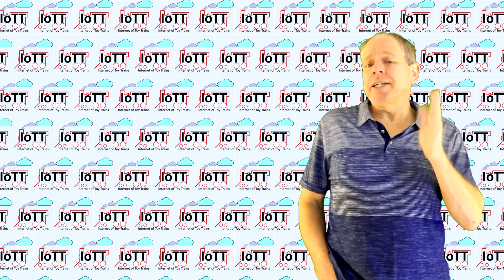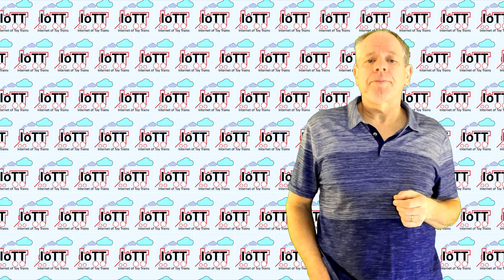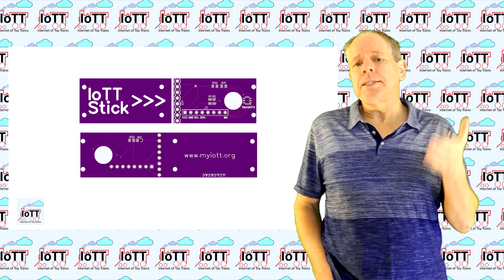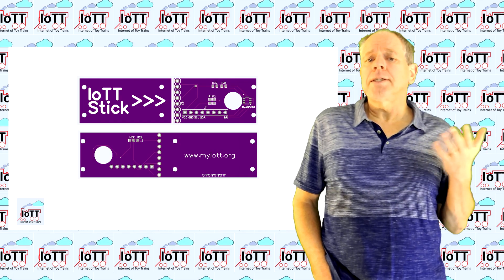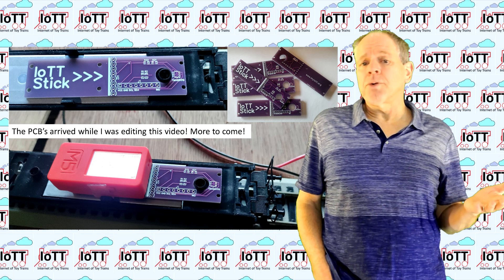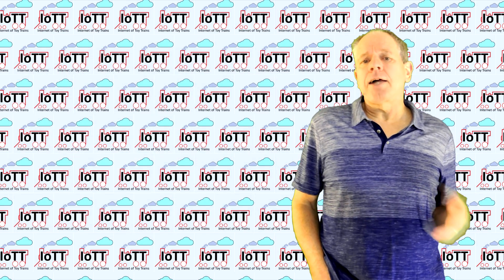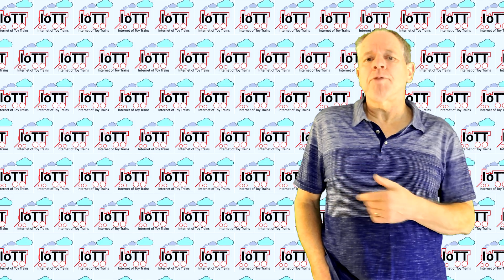So it looks like shrinking the axle sensor to HO and N-scale really is feasible. On the electronics side, things are looking good as well. For the HO-scale measuring car, I am currently waiting for some PCBs which will fit in an HO-scale car and serve as a carrier board for the Hall sensor and the IMU and provide a head connector for the IoT T-stick. These elements together will make for a pretty simple to install do-it-yourself track measuring car kit that can be installed in a wide variety of freight cars. And since the IoT T-stick has a built-in battery, time-limited operation will work without power pickup from the rails.